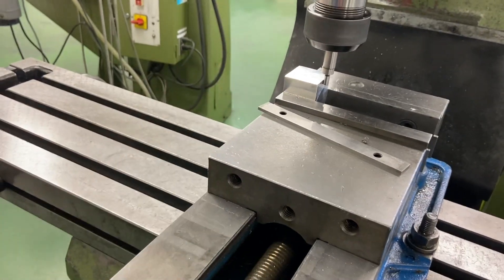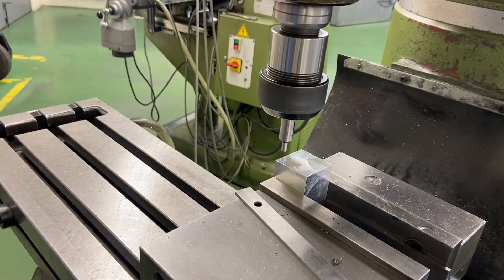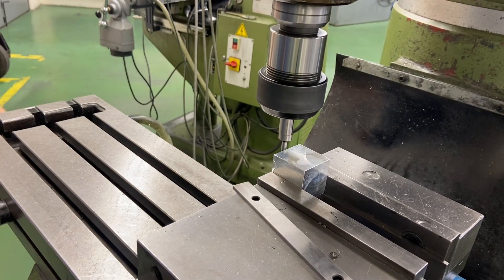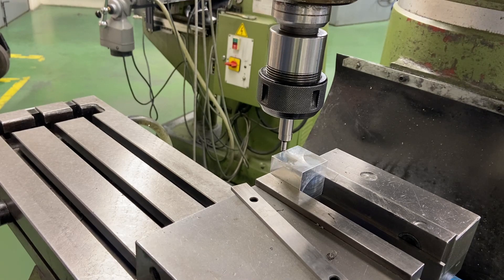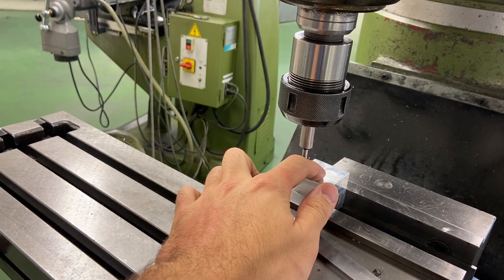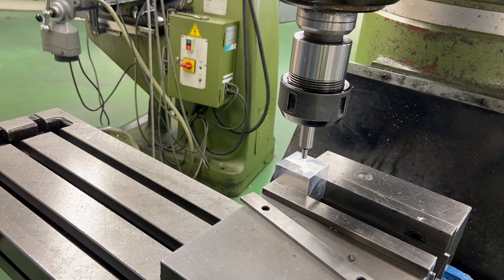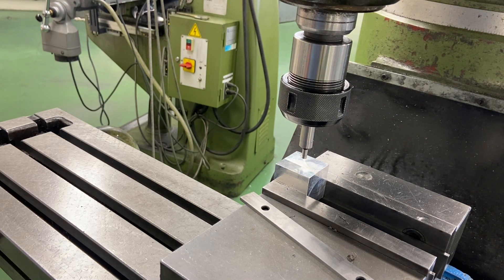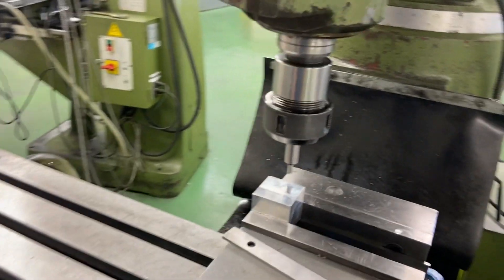Then I can come and touch the other side. I'm here on the other side now, so I'm going to raise this up and touch this edge here — that distinct pop off right there. I'm going to shut this down. If I look, my DRO is saying 1.640. So what I can do is divide that by 2 and then come to the center — that would be 820. So I come here, go my 820, zero it out, and then I would just need to do the same in this direction.